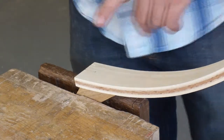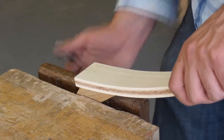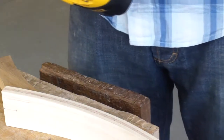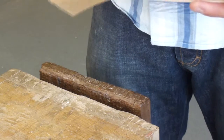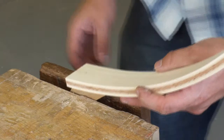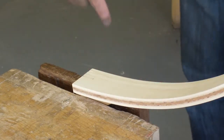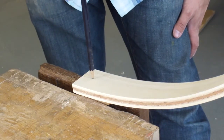What I'm going to show you is how we're going to drill our hole for the screw. We're going to use a 2.5mm drill placed in an electric drill. This shows the point where we're going to drill the hole. I'm going to place the work into the vise so that when I drill it, I'm going to drill down at 90 degrees.